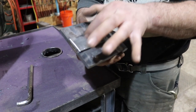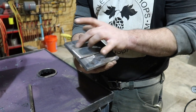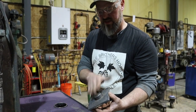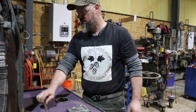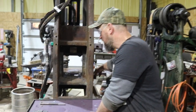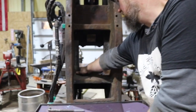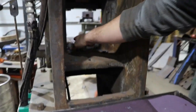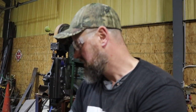I built this nice bench for tooling. This is the only other tooling I've made — a top tool that slides into a groove in the ram and is stopped from moving anywhere with washers. It's a basic round die, perfectly sized for a votive candle, so I can use that in some procedures. Around the back you can see my tooling holder: a piece of one-and-a-quarter-inch scrap plate that flattens the table. I have two nuts you can loosen so this gate slides up and the bottom tooling slides out, but it's held rigidly in place and can index with the top tooling without sliding around or shooting up.